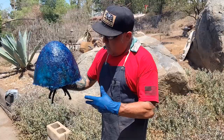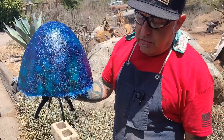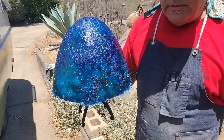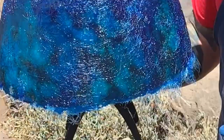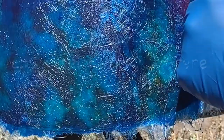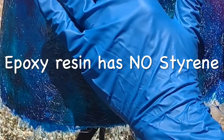We went around the entire bullet planter with a full coat of fiberglass and overlapped them several times. We're going to let this sit. You don't want to put more than about three layers on at a time because there's a thermal reaction that can happen, so we're putting one or two layers on at a time. Also, don't use epoxy resin — use polyester or vinyl ester resin. The reason is that when you put epoxy on e-glass chop strand matting, it's hard to get the fiberglass to conform. Polyester or vinyl ester resin will melt those binders keeping the e-glass strands rigid, so it conforms much better.